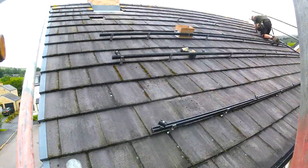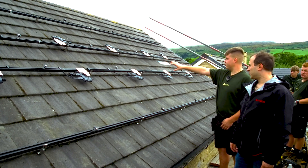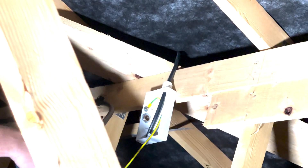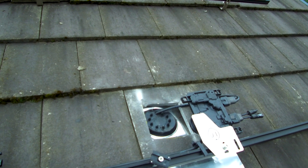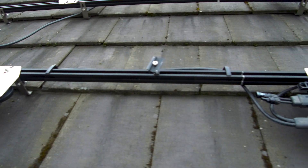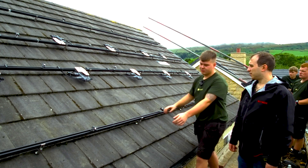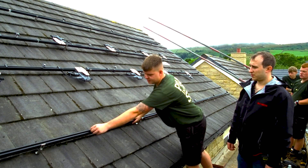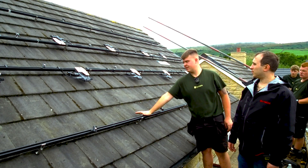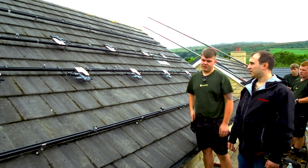So you're ready to put the panels on now? Yes, already. These are the microinverter cords — this is where we plug the panels in and this is where all the power runs through into the loft where we've got a metal sheet for the wiring. We secure it to the batten, cut a tile around it so all the wires can go through without making a leak, then silicone the bottom so it doesn't flap in the wind. We put the bottom panel on first, plug it in, then carry on screwing down with mids and ends. If a panel wasn't plugged in, we'd be able to locate that on the app and sort it out.